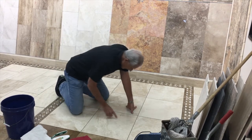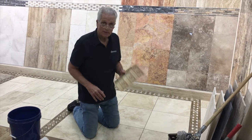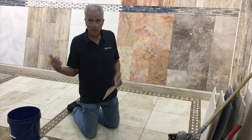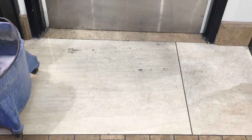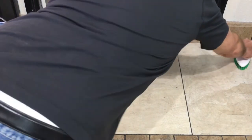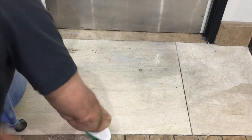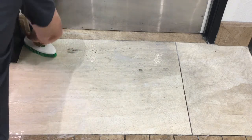If there is an extra soiled place, this is sandpaper — wet or dry sandpaper, 220 grit. Sandpaper may be used to get a really bad spot. Here we have a very soiled area — it's the entrance to our warehouse. We have forklift tire dust, the most nasty kind of dust there is. Maybe you have a pet, or worse, a boy in the house who makes a mess. We begin by scrubbing the floor using a brush, because you want to get down into the pores that hold the dirt. We always use circular motions when cleaning the stone, because that maintains the finish instead of engraving the finish.